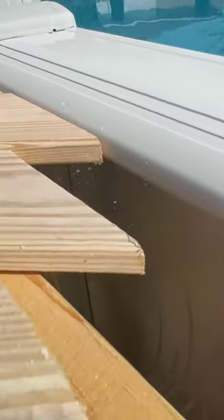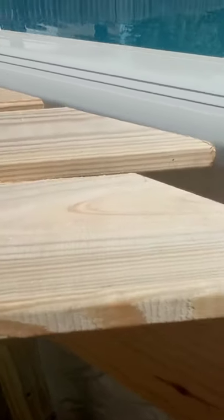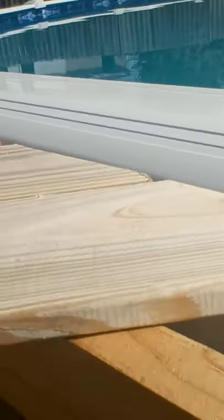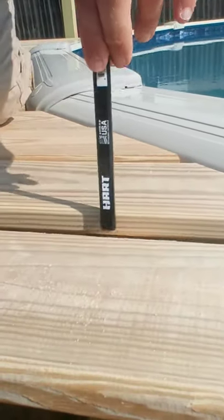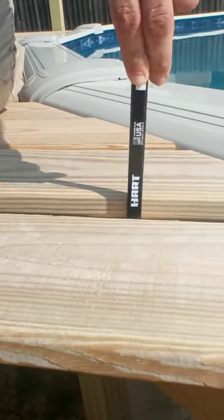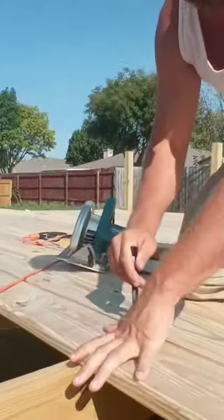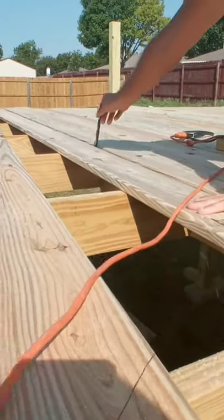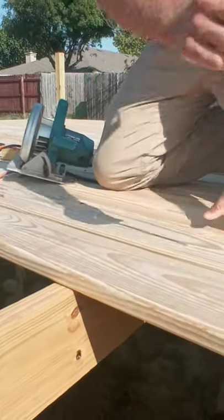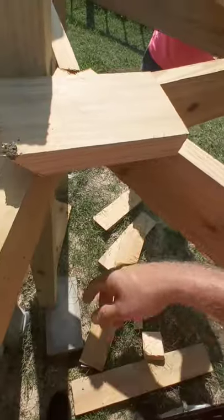Here are the ones I've cut so far — this is how it should work, sliding right into place. When you're doing a deck, take a pencil and stick it in between your two deck boards. Don't put it this way because that'll make a half-inch gap, which is too big. Turn it this way to give yourself a quarter-inch gap between every board. You have to keep doing it on every single joist or you'll end up with a gap that's too big or too small in the center.